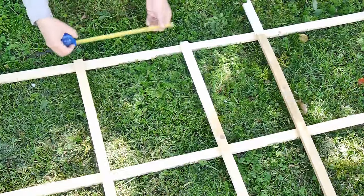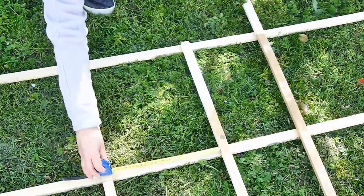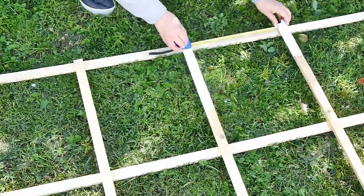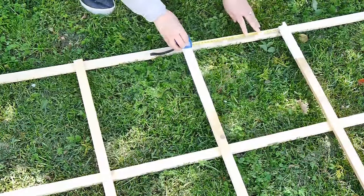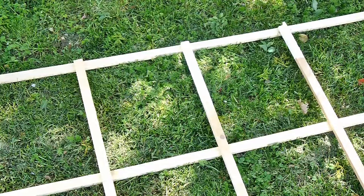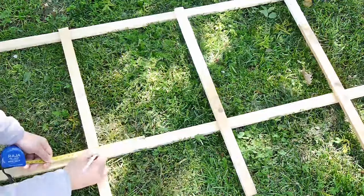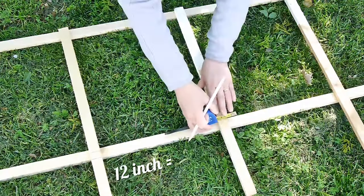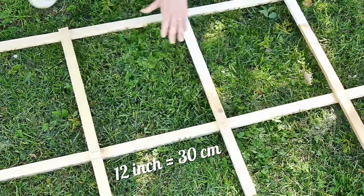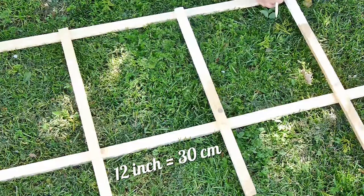As you can see, they're all different sizes but the same thickness. You don't have to use the same thickness wood — you could use thin pieces for the sides and something a little wider for the steps, it's up to you. What I did first was measure the gap between each step and decide how many horizontal steps I needed, depending on how much wood I had. I used about 30 centimeters between steps — I'll leave the inches conversion in the description box. I ended up having five horizontal steps.